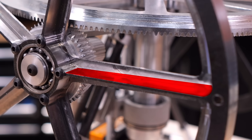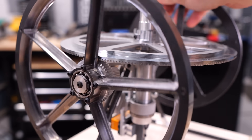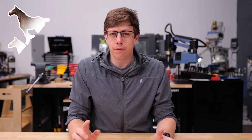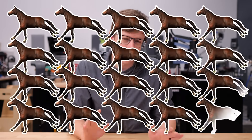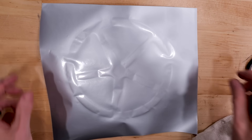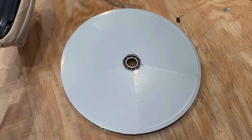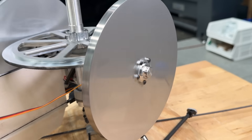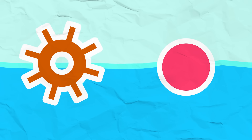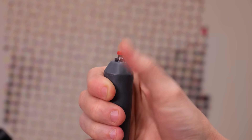Then it finally clicked: it's the flywheels. As this little flat part of the flywheel spins around, it's pushing air out of the way. I ran the numbers and it's astonishing — to spin the flywheels at 20,000 RPM takes about 20 horsepower, which is a lot. The fix is pretty easy now that we know the problem: seal them up with a super light heat-shrink film. There's no more big flat surface dragging through the air — just a smooth cylinder. Think spinning a paddle wheel in water versus a smooth cylinder — way better.